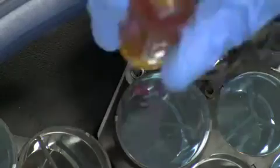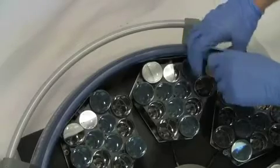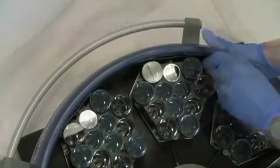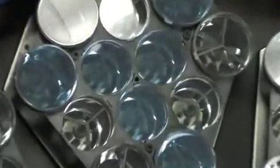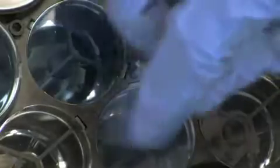To replace the LED modules, you must first remove the outer perimeter screws. The E558 and E668 both have three perimeter screws and washers securing each LED module. Once the perimeter screws are removed, you must loosen the central screw that fastens the LED module to the dome. This is either a recessed screw as shown, or a post, which must be loosened.